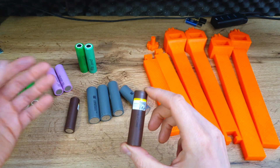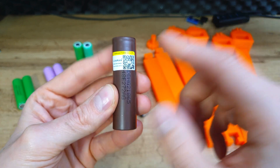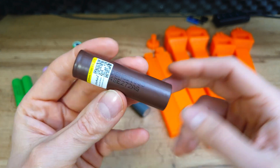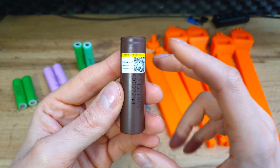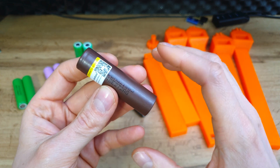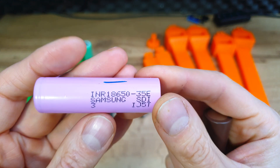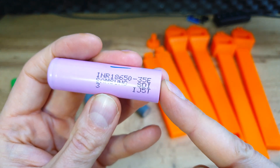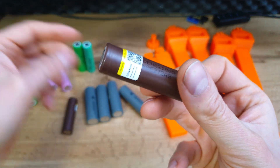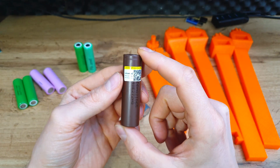You have to find a good source because there are so many fakes. I'll link two shops where I bought these batteries. The price was $2.50 and I made three battery packs. The one mostly used for a Bosch power tool — which needs plenty of power — showed about 20% capacity drop after one year, which is quite a nice score. Even the Samsung 35E, which is expensive and rated at 3.5Ah new, can drop to 3Ah after 40 charging cycles. So 20% drop for $2.50 is really not bad.